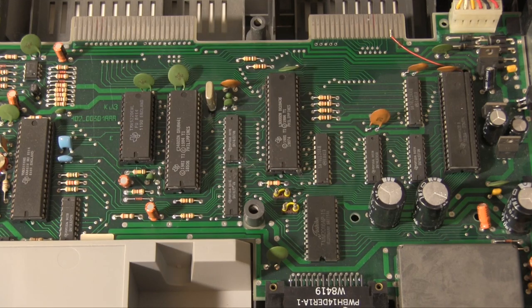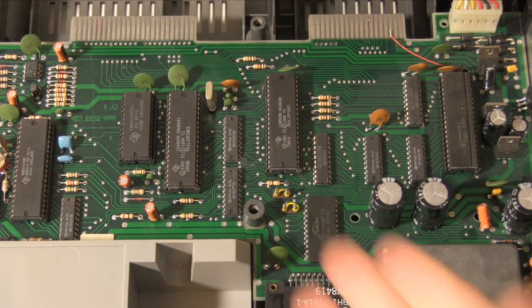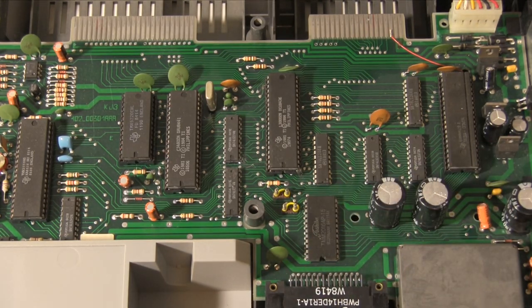And the graphics are again another, obviously, Texas Instruments chip, a 3556. So yeah, fairly different for the time, really. The sound chip, which is a 5220, again TMS, is not bad. It's not a terrible sound chip at all, and can also handle speech synthesis, although obviously this being a French computer, all the stuff built in is for the French language.